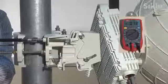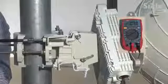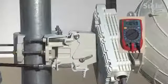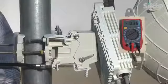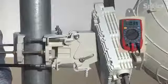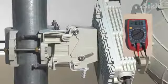The objective of the antenna alignment is to achieve the expected received signal level, or RSSI. Both the azimuth and the elevation should be scanned to verify that the antenna is on the main lobe. Perform fine azimuth and elevation alignment using the adjustment bolts, identifying the main lobe until the expected receive level is achieved, which should be within plus or minus 4 dB. Sweep over both azimuth and elevation so that the antenna's main lobe is pointing at the remote radio with the strongest measured signal. Once the optimum position has been achieved, tighten and lock the azimuth adjustment lock bolts first. Tightening the azimuth adjustment lock bolts may tilt the antenna, so realign the elevation again for optimum position, then tighten and lock the elevation adjustment lock bolts. Use the voltmeter to verify that the RSSI has not changed after locking all the bolts.